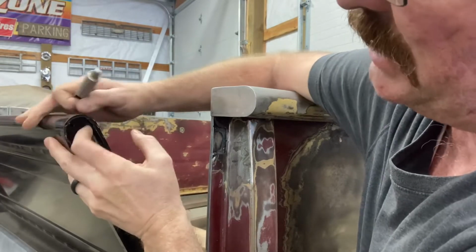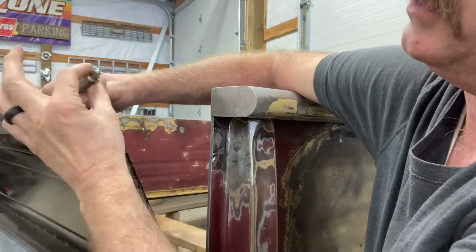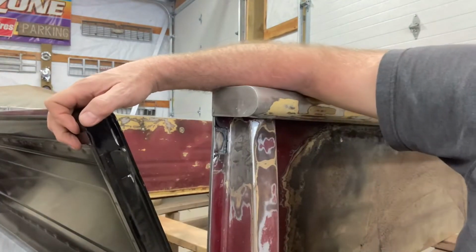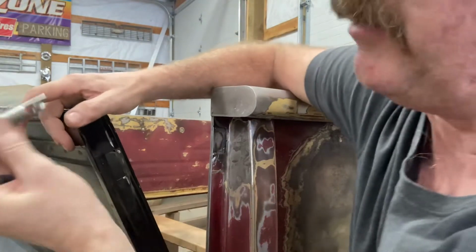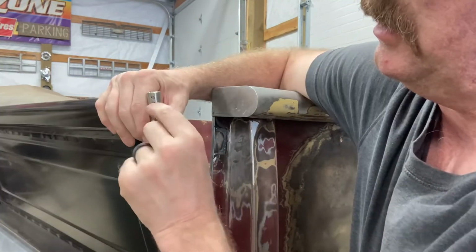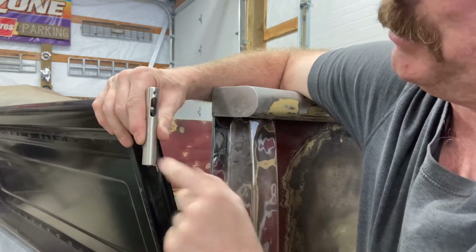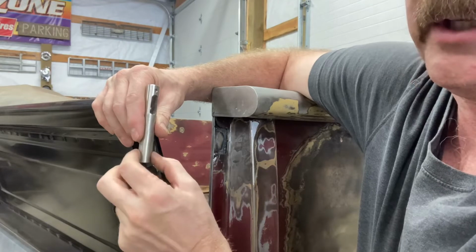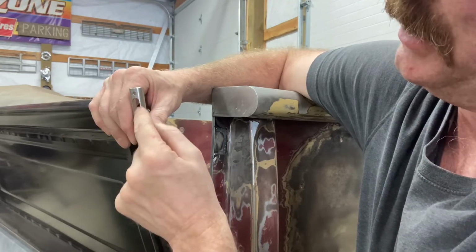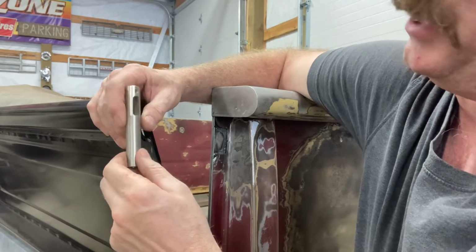So the concept is you drill a hole through here, 5/8 hole. That's 5/8. You take these out. You have an empty barrel like this that'll slide in that hole. You need to drill out a hole for this screw. This is the one that actually holds it in place along with the hole that you drill here. It's a tight fit. Then you drill 2 more holes and then you cut out that center spot for the slot. Pretty easy deal.